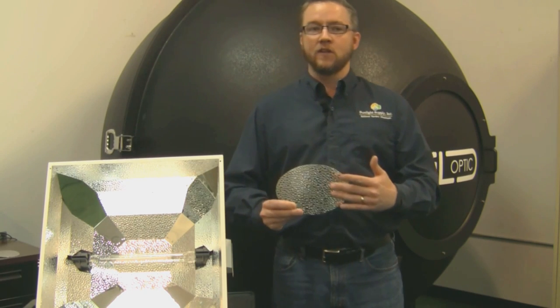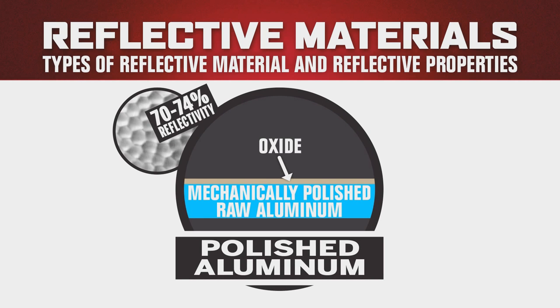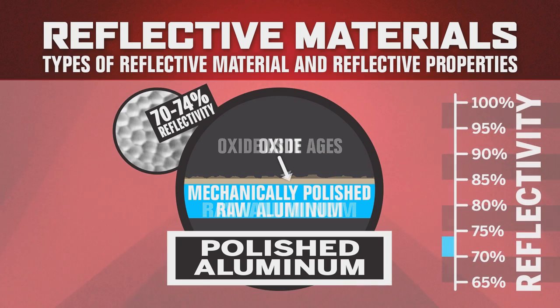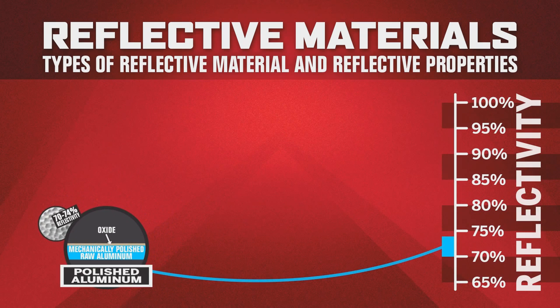There are roughly three grades of reflective aluminum being used in the vast majority of reflectors being sold in today's market. The lowest grade is a base aluminum that is mechanically polished and allowed to naturally oxidize, which occurs when non-treated aluminum is exposed to the oxygen in the air. This is referred to as the passivation layer, or native oxide. Heating and cooling of this raw material is a catalyst for further oxidation, which obviously occurs when the lamp is operated and then shut down. This results in an uneven thickness of the oxide layer as it changes over time. This naturally occurring unstoppable process greatly affects the reflective properties of the material, especially in the lower UVA wavelengths, which can be critical to the plant's growth response. The oxidized alumina typically measures total light reflectance in the very low 70 to 74 percent range. We do not use this material in any of our hoods, but this low-grade product is most often found in cheap Chinese produced reflectors.